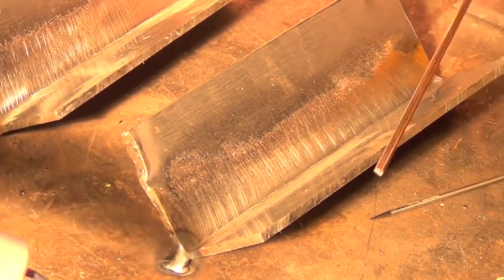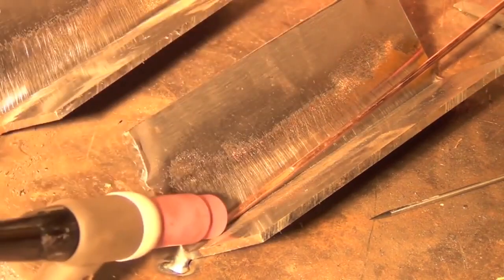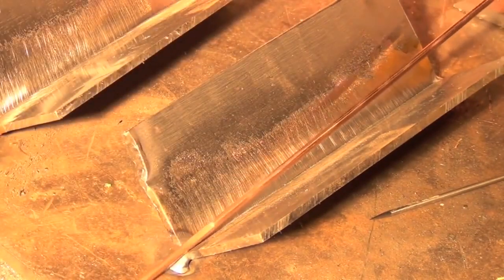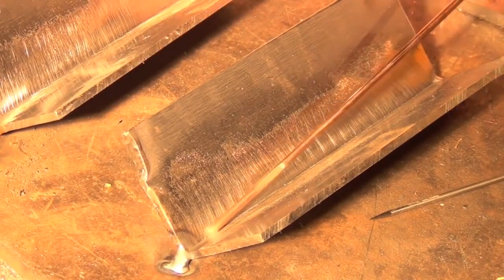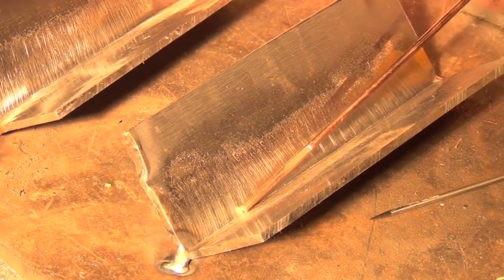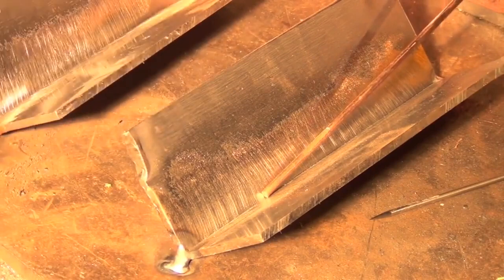Now we're going to be welding with what's referred to as the lay wire technique because, to nobody's great surprise, you just take your wire and lay it into the joint, and then you take your TIG torch and run it over. Another thing to keep in mind is that you can't just rest your filler wire in there like I was kind of doing. If you do, you can slide around, or you move your body a little bit to reposition yourself for the weld, and the wire slips forward and impales your tungsten. That's a really bad time. This is more of an issue on pipe than it is in a 1G inside corner weld. Again, it's probably not a bad way to start out.